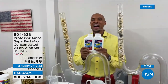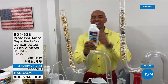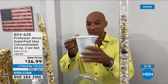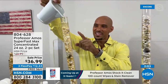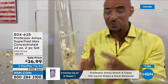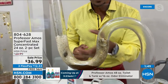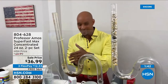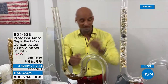You take an application and put it right into a cup of hot water. Super Fast Max has an accelerated formula — it works on contact. You're waiting 10 seconds for it to start to work. It turns your hair into foam, your food into foam, all the dirt, greases, and oils in the drain line into foam — that's called saponification. That's the dynamic way it works. You let that take place for about 10 minutes and it's all going to be liquefied, then run hot water for five minutes.